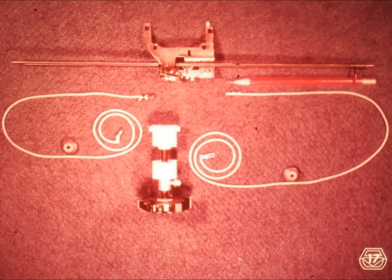We can see that while the carrier is between the ends of the two cords and has been set free to move, we can regard the two ends as being tied together, as if there were only one cord. This is another way of explaining why we only need one tension pulley on the system to take out all the cord slack.